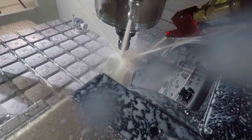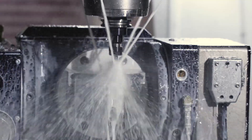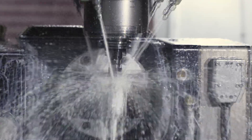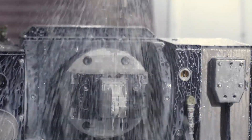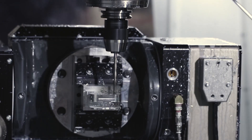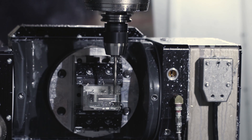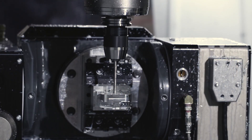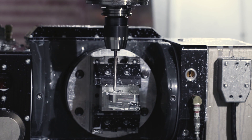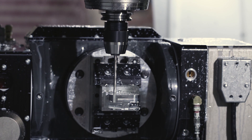To those of you that are new to CNC machining, no we are not spraying milk all over the part. We use a coolant called Quality Chem and it just happens to be white. We're toggling it on and off a lot because it's easier to see what's going on, but you do want that coolant to lubricate the cut, cool the part off, and most importantly evacuate those chips away from your part so you're not recutting the chip.